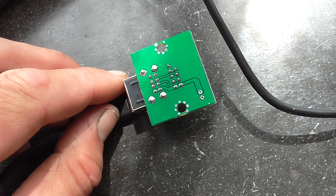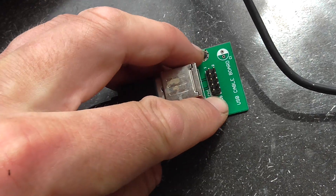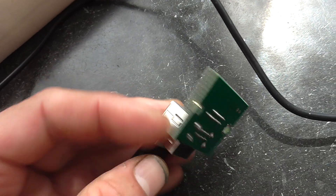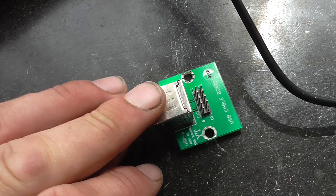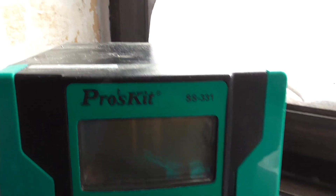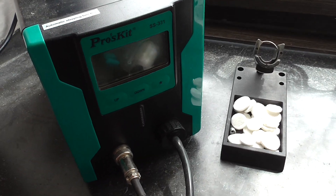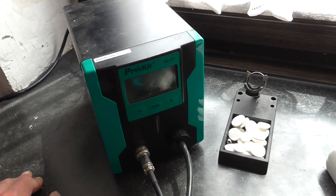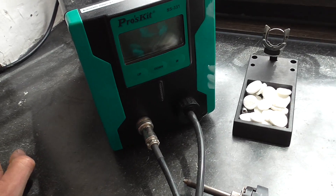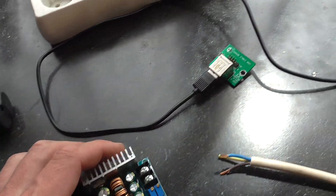For using it, I just need to make sure the polarity is right — minus on this side and plus on the right side. The data pins in the middle are somewhat in the way, so I will remove them with this desoldering device called the PROSKIT SS331. I got it on Banggood for around 100 bucks. It works very well — I've used it for quite some time, desoldering thousands of parts.